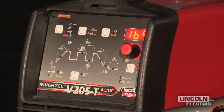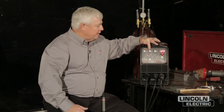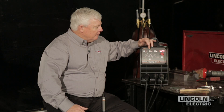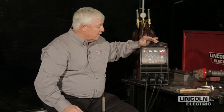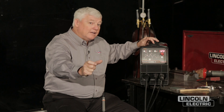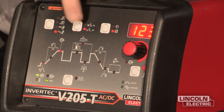I happen to be on AC right now, so I'm going to do aluminum and magnesium on the AC function. Now let's take a look at this second white function button here. It says 2S or 4S — 2-step or 4-step. I want to run it on 2-step because I'm going to put a foot control on, and I want that pedal to activate the argon gas via the solenoid inside. If I go to 4-step, I can put a button on my TIG torch, hit it to start the arc, and it'll stay active until I hit the button again to extinguish it. So those are two features you have the choice between. I'm on 2-step and I'm going to put the foot control on.